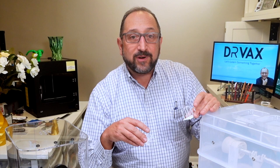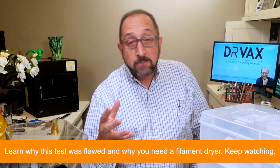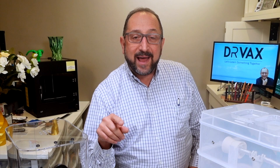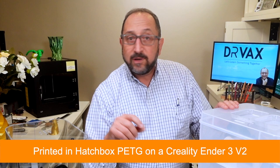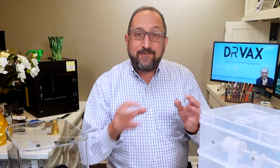Both of these were printed with PETG. Now PETG strings a lot, so I assumed a print dryer would make a big difference. But PETG strings a lot if you don't have the temperature exactly set properly. Those were probably printed a little too hot - at 235 degrees Celsius. In addition, they were printed on a Bowden-style printer, my Ender 3 version 2, using the off-the-shelf Cura profiles. Those weren't really tuned profiles. Those profiles print PLA great, and even print PETG just fine if you don't have a geometry that would cause stringing.